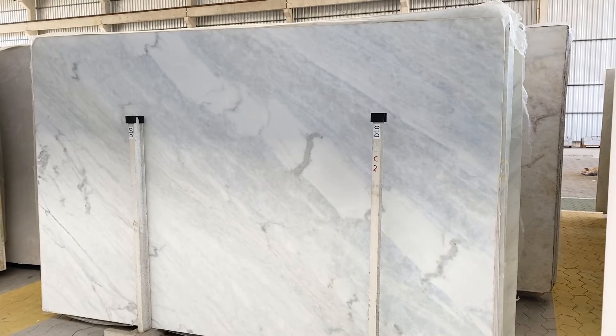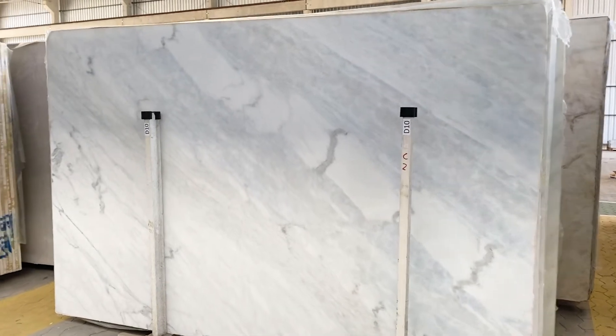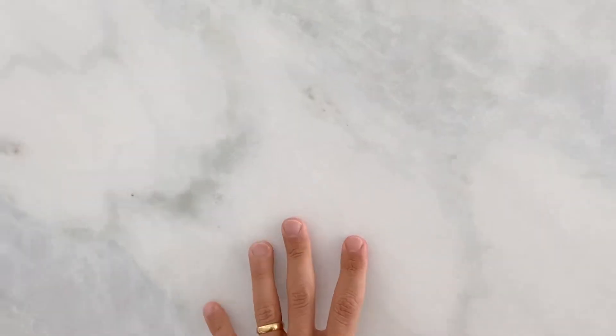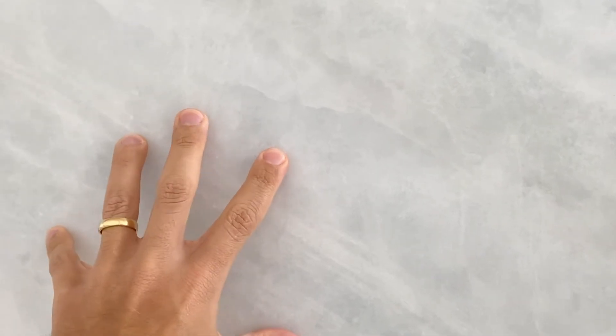That's the Venatino White Dolomite, block 108-57. This material is a hard dolomite marble — very white and very resistant, mixed with some quartz, so there are crystals here. The entire slab is translucent. We have a very nice and smooth honed finish, so this material is resistant to scratches.